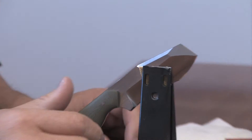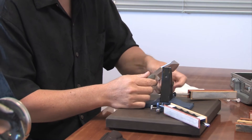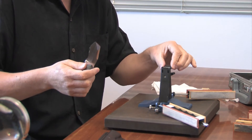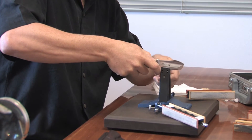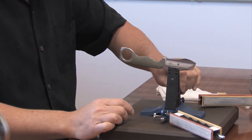For the next portion of the blade, I just take it out of the clamp, pull out the little piece of chamois, and then I take the depth key and put it into the top set of holes, set the knife firmly on top of the depth key with the blade up, snug it up, and it's ready to go.